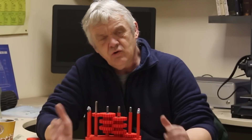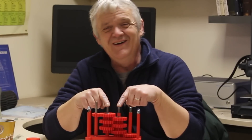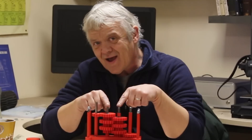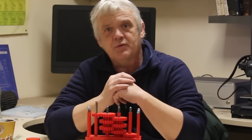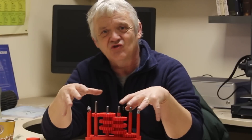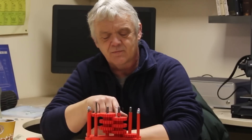On a practical matter: when I decided where to put the holes, I used the radius of the two reference circles — and I added a quarter of a millimeter to each, giving a tiny bit of slop. Because we're 3D printing in plastic, a little slop doesn't hurt at all and helps the whole thing turn freely. So I added 0.25mm to the total of the two reference radii.